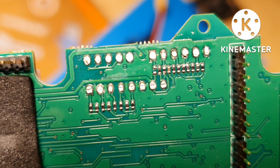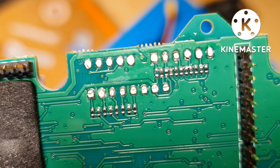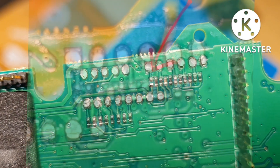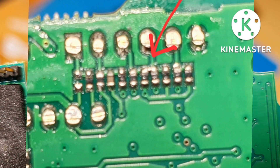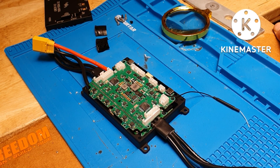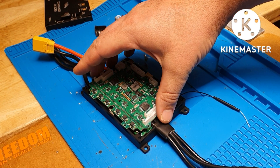This is what you see on the screen — that's the issue. You can see where two contacts are touching each other. So now, very carefully, you need to clean the solder in between so it doesn't touch, then reverse everything back as it was.